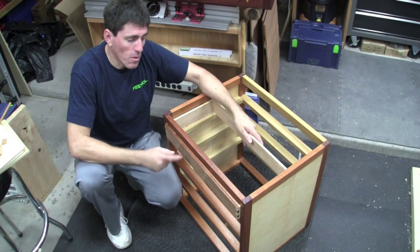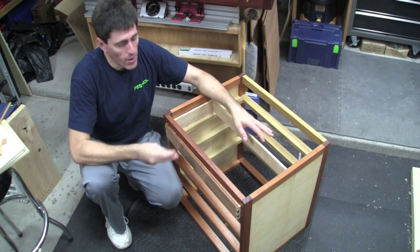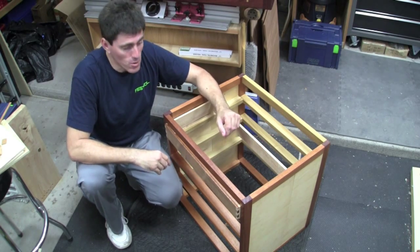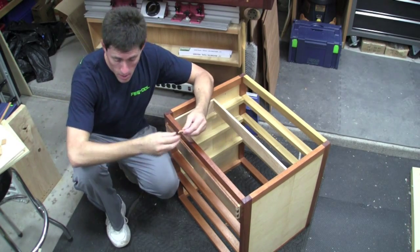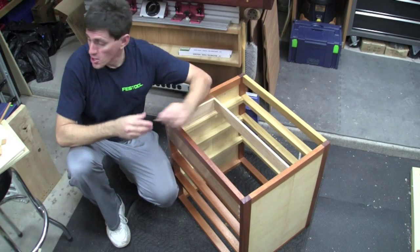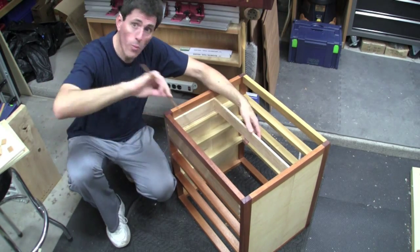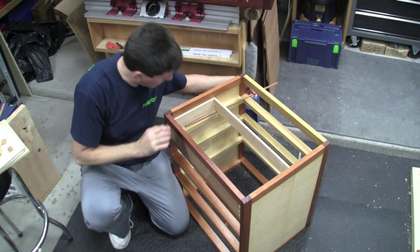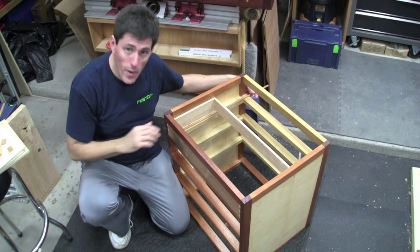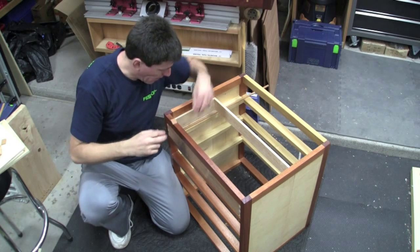But you'll see that we're going to do some modifications to the drawer after we do the guides and the stops. That's going to fix all that and make it really nice to use. Now the way I'm going to be attaching these is I'm actually just going to use a nail gun. I'm going to put first the chicklets in, and then afterwards what I'm going to do is, while I have the drawer open without the bottom on it, I'll slide one of these mahogany strips up on each side all the way up until it abuts against this chicklet that's used for the drawer stop,